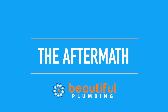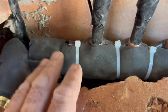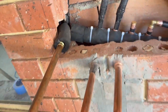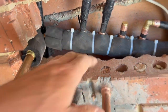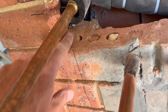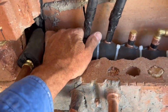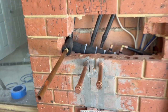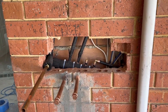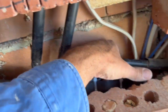Okay, so that's the manifold system all installed. I've just wrapped it with some self-sealing tape and chucked a couple of things on there, so that's all going to sit inside the wall. It's mainly for expansion and contraction — I just don't want it resting up on anything. That'll slot down like that, and that's all you'll see coming out of the wall. Just brick that up and then plaster it, all hidden behind there.